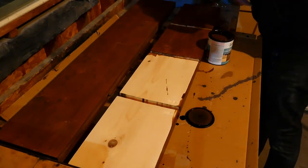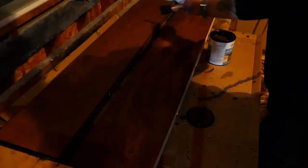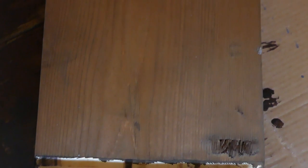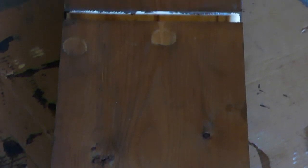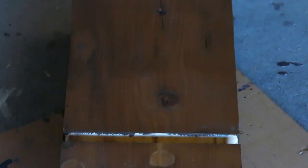I then did the same with the sides of the shelf, except I used Varathane's aged wood accelerator this time. It worked out even better — it came out in a nice dark tone, making it not at all obvious that it was pine. The next day you could clearly see where the cardboard circles were, but I was able to orient the boards so those marks are just underneath the shelves, making them not visible in the final product.